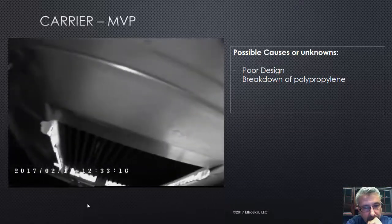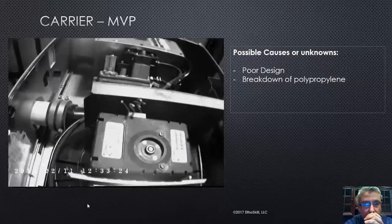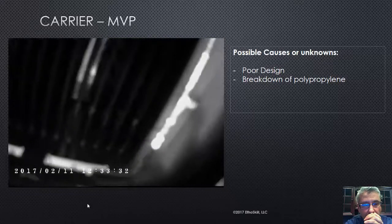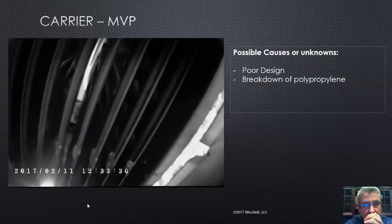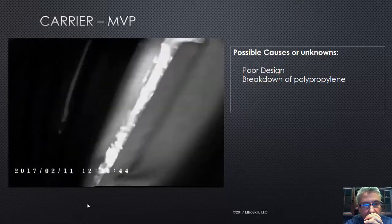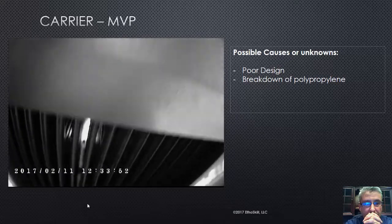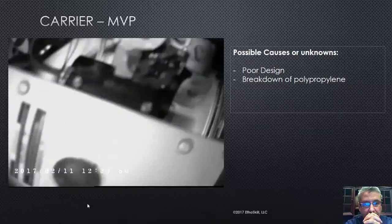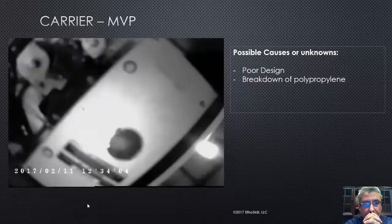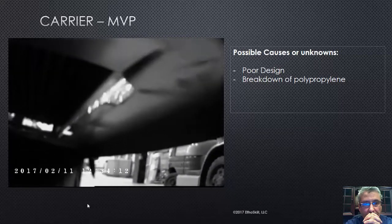What do you want to check on this one? When you see this furnace, one of the things you always want to check is that secondary. Look for that corrosion — you can see it real good right there. Polypropylene is breaking down. These will also plug up. If you pull your inducer assembly, search 'carrier plug' on Rapid Tech — there's a video on plugged secondaries. Check your washboards on the primary, check that secondary, and check to see if the secondary is plugged.